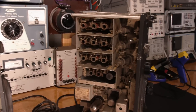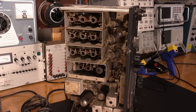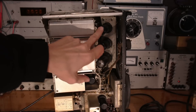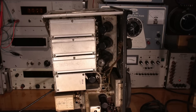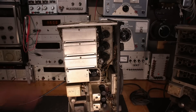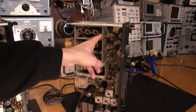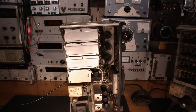There are three grid caps on the first receiver. On the second one, none of the tubes have grid caps at all — they're all the SK-series type, like the 6SK7, whereas the first has tubes like the 6K7 which require the grid cap. So the first receiver must be an older design because of those grid caps. Maybe this one here with all the additional coils might be a better performer — we'll need to look at the schematics.